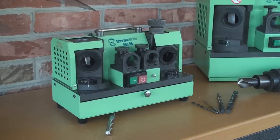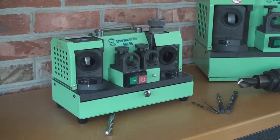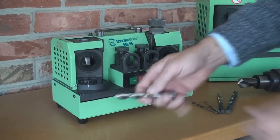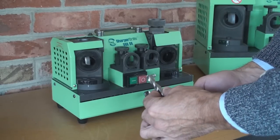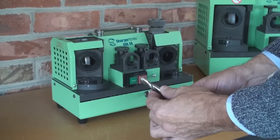Hi there. Next I'm going to show you how to sharpen a NACHI SGES style drill point on our Sharper Drills DGS09. As an example we use a parabolic drill which has a NACHI point on it — it's a 135 degree drill point.